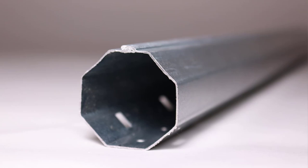One important note regarding 40mm tubes: you always need to use a tube with the seam on the outside, because there's not enough internal space otherwise for the motor. So if you're converting a shutter with 40mm tubes, you need to replace them — we have them available from stock. Rigid connectors that come with these brackets are a must-have as well, as there's no internal space for rivets or screws. Those might damage or scratch your motor and void the warranty, so that's definitely something you want to avoid.